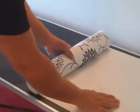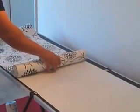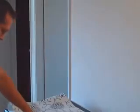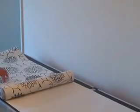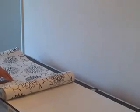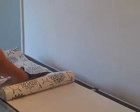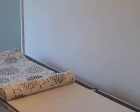So we turn the paper over, we'll put the paper to the edge, roll the paper all the way down to the end of the table. Just hold it on the end, don't crease it, just hold it down lightly, and roll your paper back 600 mil. And then get your scissors and cut from one pencil line straight across to the other. And that will give us a paper of 2.6 drop. And that's a lot easier doing it that way. Okay?